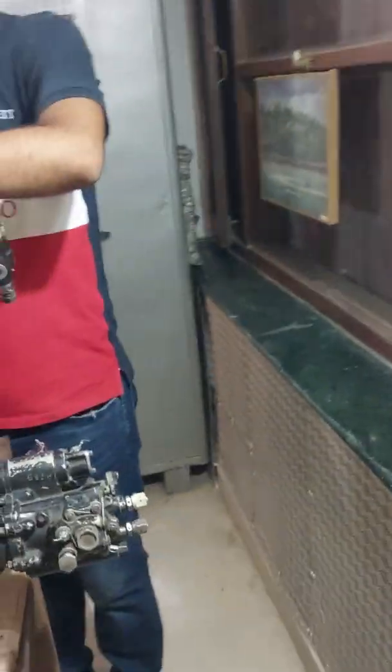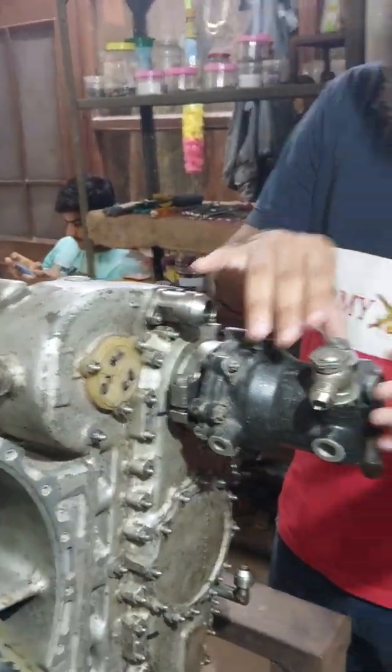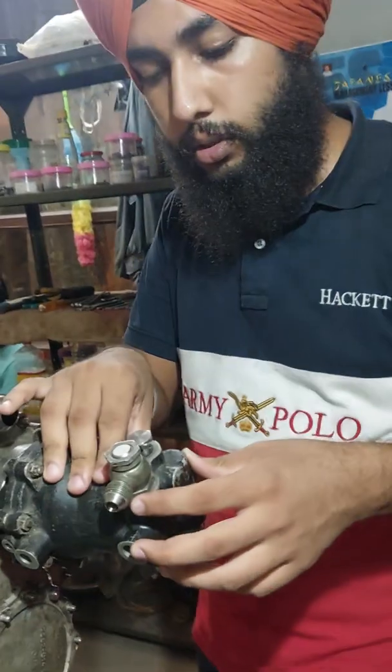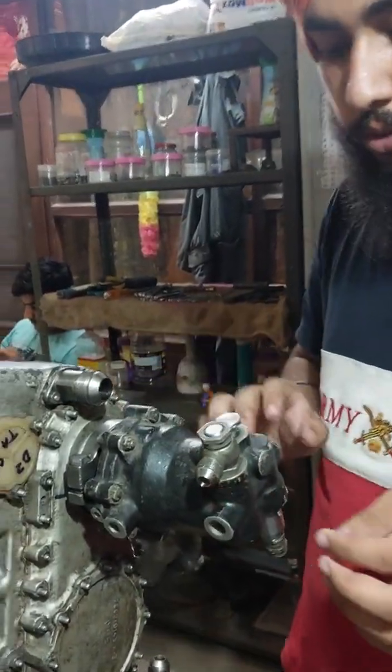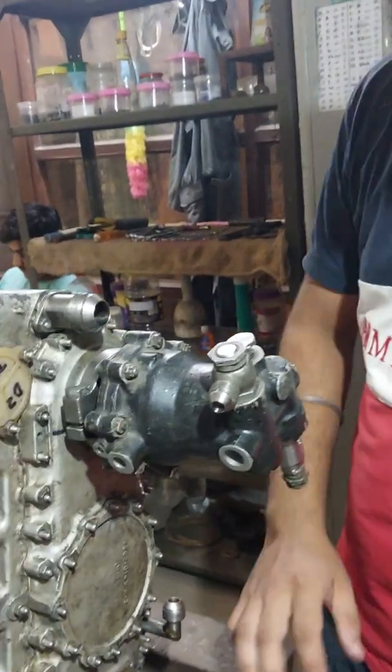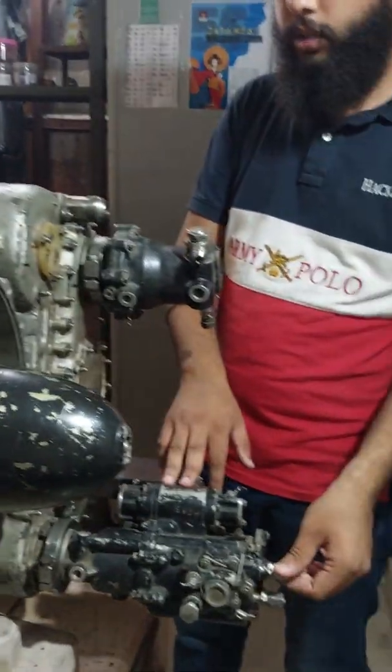After that we have the accessory gearbox. In this we have the N40R plunger pump, which regulates pressure to about 27.5 kilogram-force per centimeter squared. This is the KAR-40 control unit, which gives both hydraulic and electronic signals.